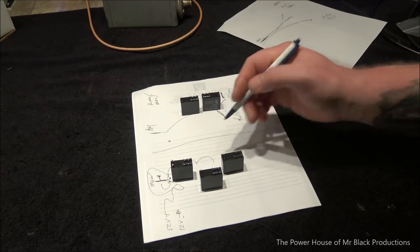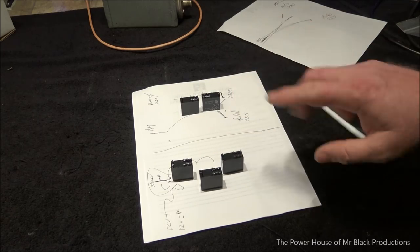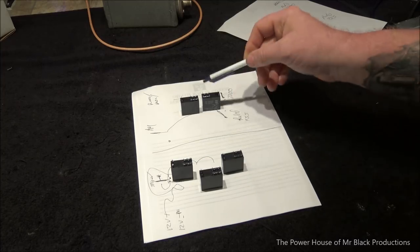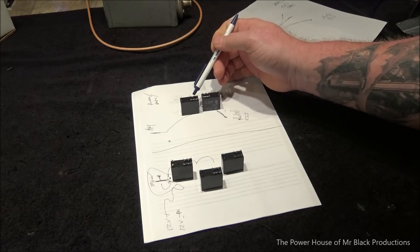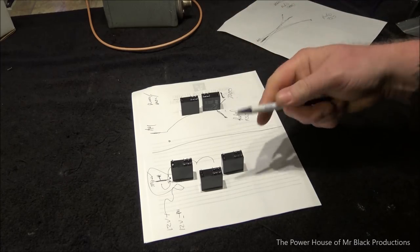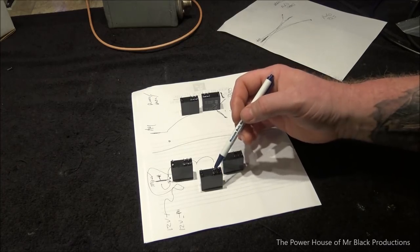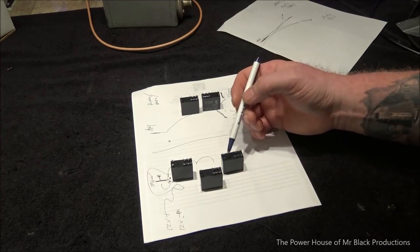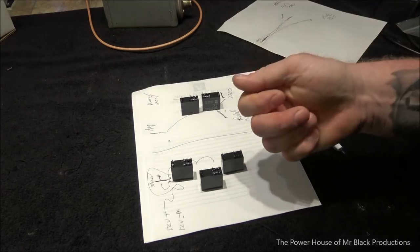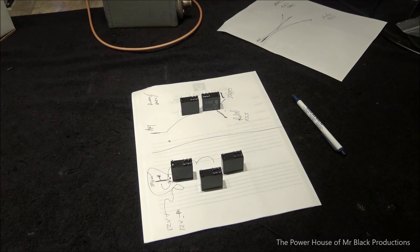full circle. This side of the relay will trip this relay. It'll in turn pull a signal and it'll close two contacts, which will take the 7300 into transmit. That same cycle has to repeat itself over here. Then, because we're going to trip the 7300 first, then in turn, this relay is going to charge this relay with a ground from here to ground, and then from here to this relay. Will in turn trip this relay, which will cause the 955 to go into transmit. So it's just like closing the mics. And that's exactly how we're going to control the radios.